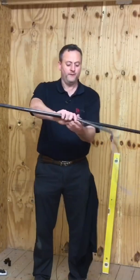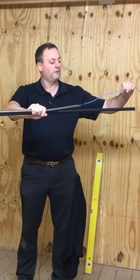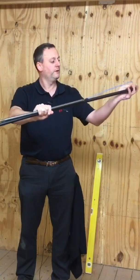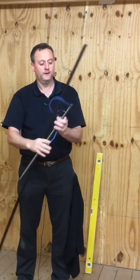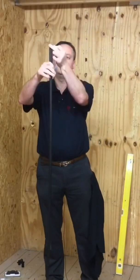The spring needs to be offered up on the outside first in order to work out the position where you want to start the bend. There's a cable on the outside to prevent it getting trapped inside the conduit. I'll just fold it over so I can drop it into the conduit itself and position it down.